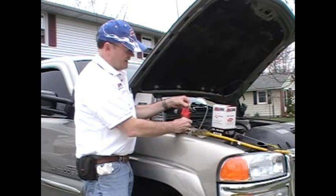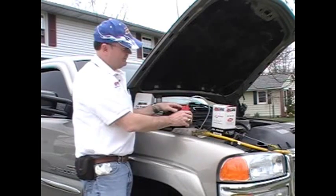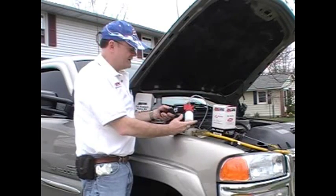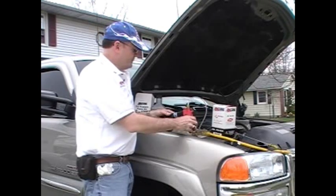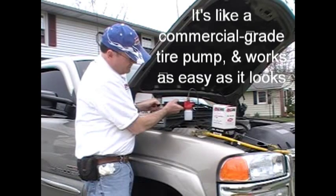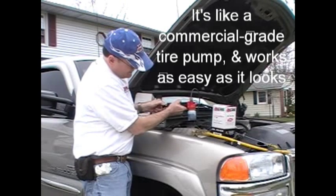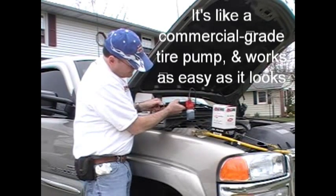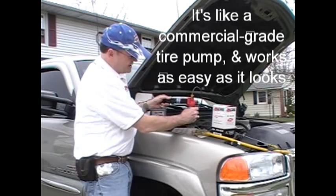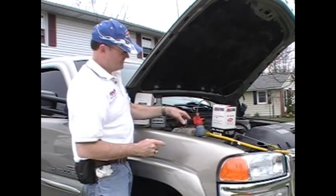The other key trick on your oil sample pump is to make sure that this plug is in at the end. If it's not, you'll pump a lot of air in and out of there and you won't understand why it's not working. There's our oil going in. And we've just taken our oil sample.